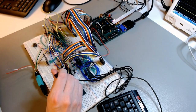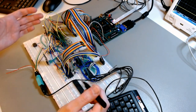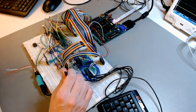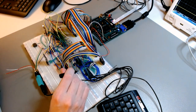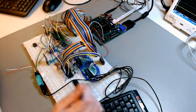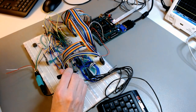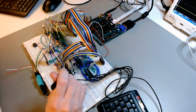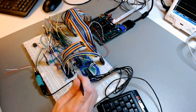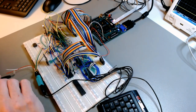We cannot leave these control signals undefined. This is particularly important in a multiprocessor system like Cerberus, where your attention may go somewhere else where the action is happening. You have to make sure that all the processors — in this case these two, and there will be a third one coming — are in a defined, known state. So they can be halted, allowed to continue after being halted, or stopped altogether or reset. You need to know that.